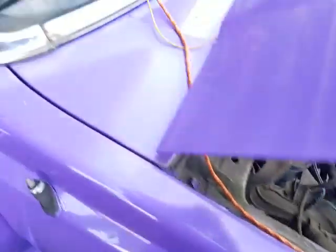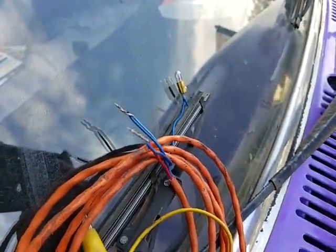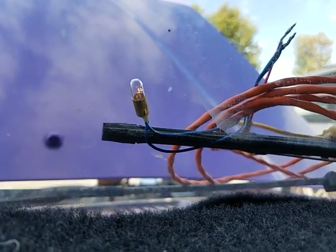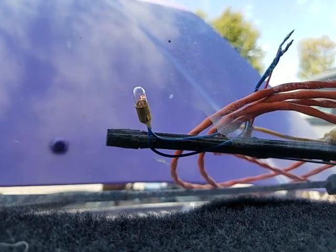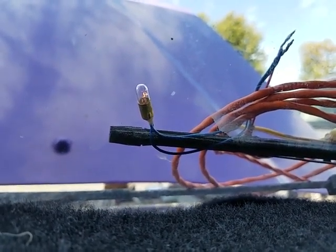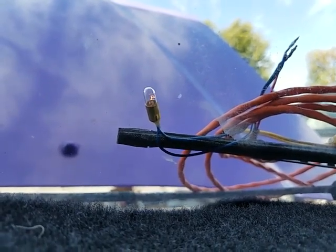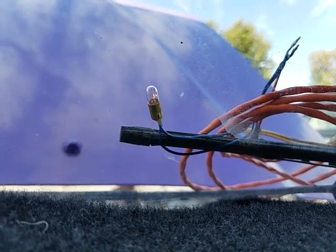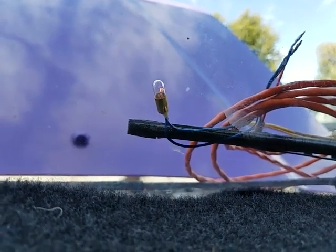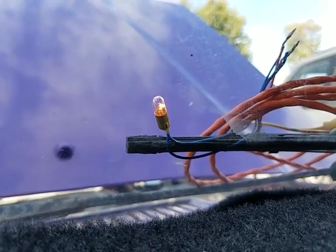If we have success, this light will flash duty cycle. We do have duty cycle there now. As the oxygen sensor warms up and the voltage goes up, that will get brighter. When it goes to 100 percent, that's it trying to lean the system out. And there it is — I think we've had success here.